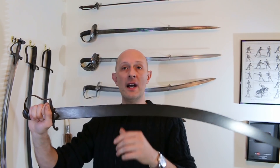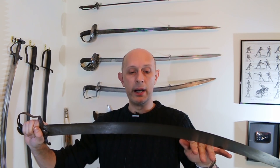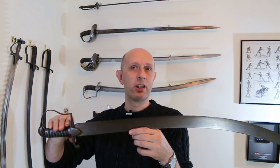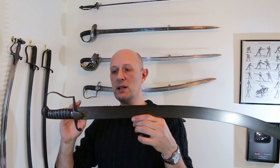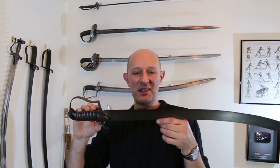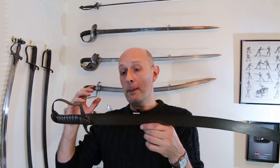What's particular about wootz is its pattern on its surface. This blade has patina from oxidization, but I can nevertheless see swirling patterns right the way along here - all around there and equally all around here and up to about there, and a little bit up here as well. You won't be able to see it on camera unfortunately. This blade is a massive, colossal lump of wootz steel, and my hypothesis is that it was taken from a talwar, or perhaps a pulwar, with a scarf weld applied to add a new tang.